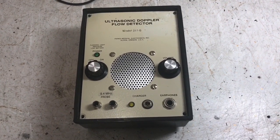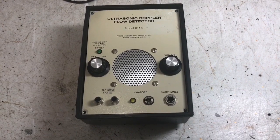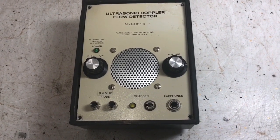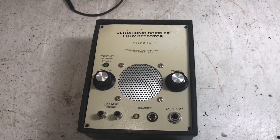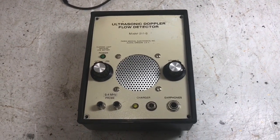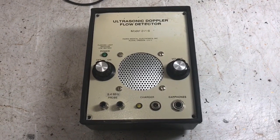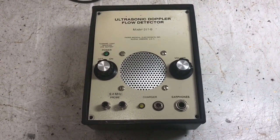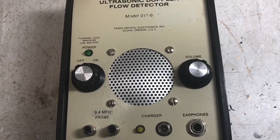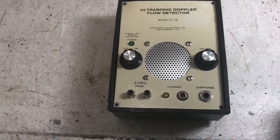Same thing with radio signals, absolutely the same way. This little device can help you listen to the blood flow, and you can hear it in the speaker, headphones, or even run it into a graph. This particular one was used in a human hospital, and the smaller probes were used to specifically target certain veins or arteries. We're going to be changing it to a different kind of probe to use in a veterinary hospital on animals, at a different frequency — 8.1 MHz, whereas it's currently set up for 9.4.